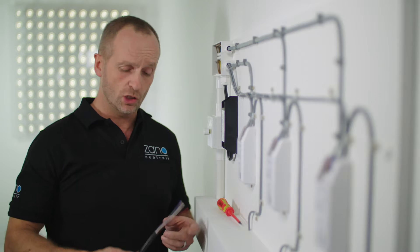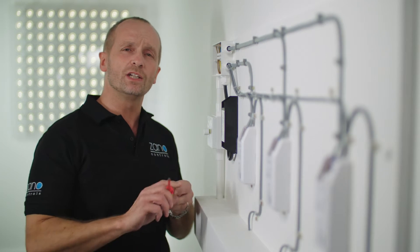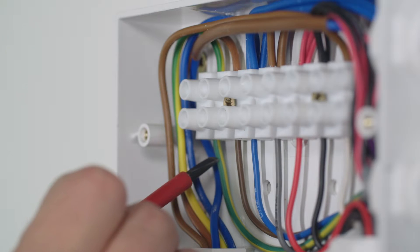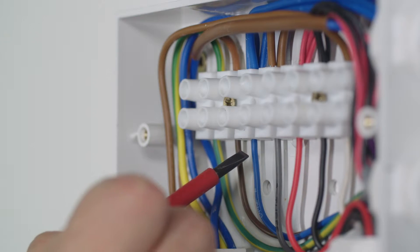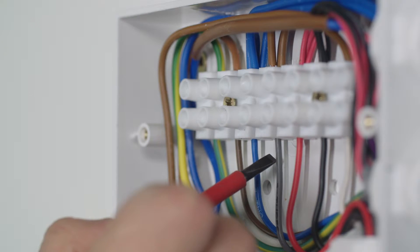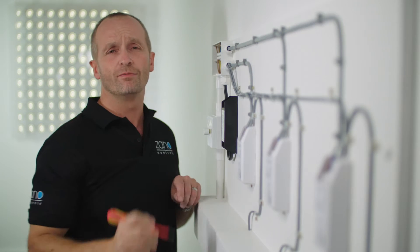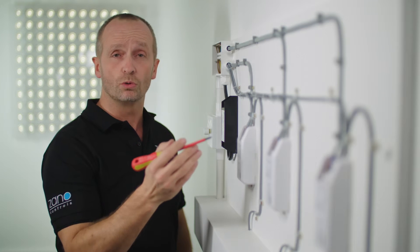The Z-Bar LED has an 8-core cable, which is colour coded and numbered. Take the green and yellow cable and connect it to the earth terminal. Then take the brown cable marked 1 and connect it to the live. Next, take the blue marked 2 and connect to the neutral. The grey cable, 3, is for the live feed to your lamps. For 1-10V dimming, the live feed is purely for switching the lamps on and off. The red and black cables 4 and 5 are your DC controls — red 4 is the positive line and black cable 5 is the negative. We've connected the live and neutral to the drivers with twin and earth, and the red and black using 2-core flex.